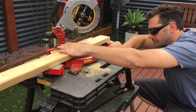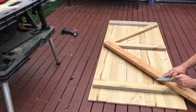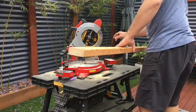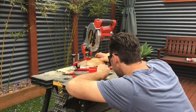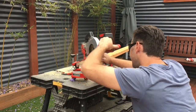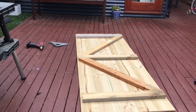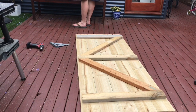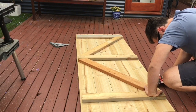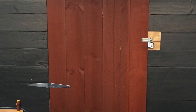I've used it to make probably three or four sheds, cutting 90 by 45s and 70 by 35s — probably 600 lengths total. One shed I was building was three meters by three meters; it took me about a day to cut, prop up, wall up, and do the roof. I reckon I'd only used two bars on a four-amp battery. The fact that it's brushed keeps the cost down and still gives you a full day's work easily.